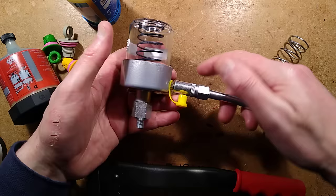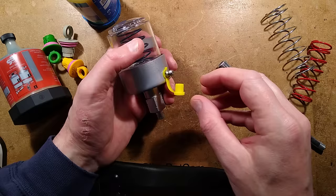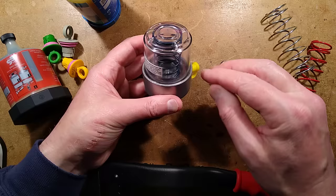Once you've done that, you take the grease gun off. Note that you don't just pull grease guns off — you tilt it over to the side and twist to actually get it off; it's the easiest way, just in case anybody has ever had any problem doing that. This grease nipple is basically a one-way valve. You cover it up again and now over a period of time, based on how easy it is to force the grease in, the viscosity of the grease and the actual spring, it will gradually push the grease into the unit. And once you see the plunger down flush with this, you know it's time to pump it up again.